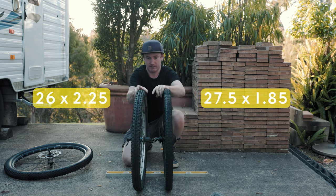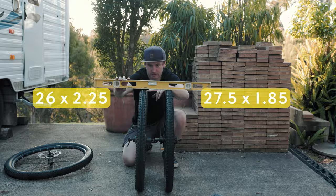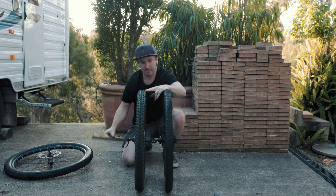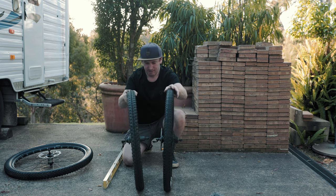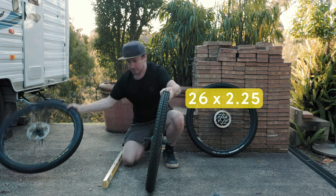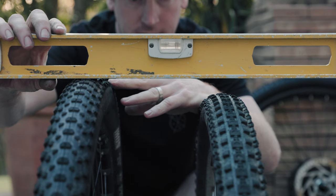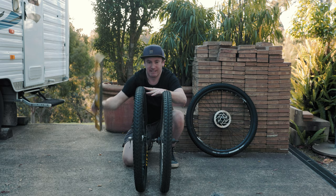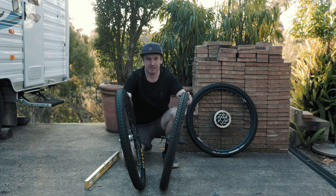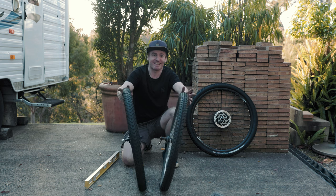But if I sit them side by side and I put a level across it, there's honestly only about 5 mil difference in the whole outer diameter. It's really not worth doing. If I compare, let's say, the 26 with a bigger 27.5, there's a bit more in it. Yeah, that's probably like nearly 25, 30 millimeters. So if you're doing it with smaller tires on, there's no point. Anyway, let's go back a few months to where I start this video and yeah,